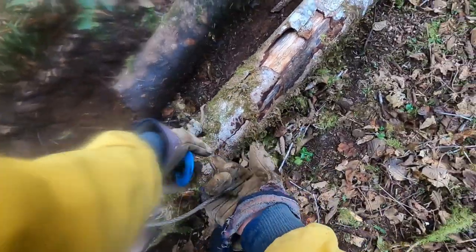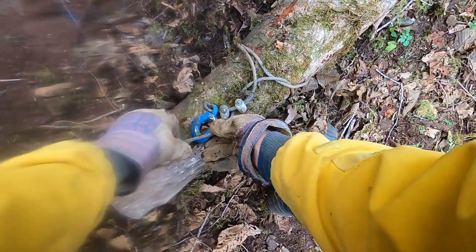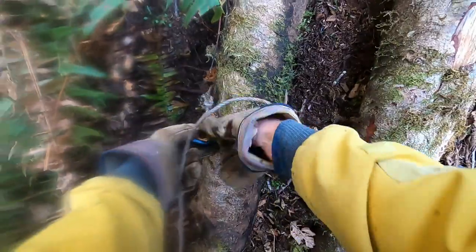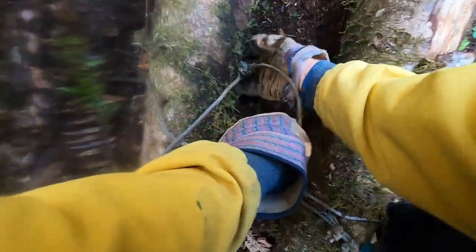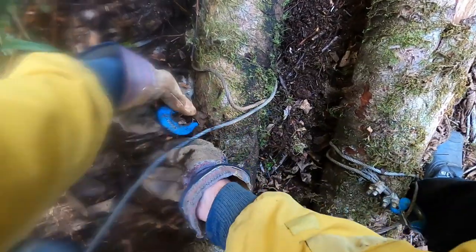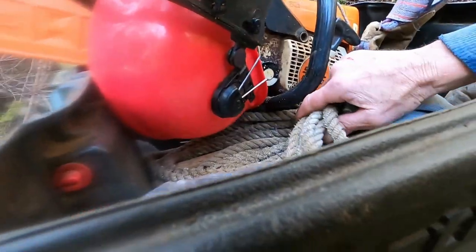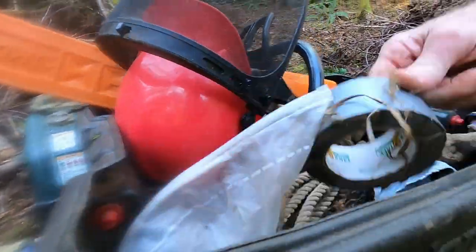The logs are small enough I wrapped the cable around twice to lessen the chance that the hook will let go, which it often does anyway. Those little spring-loaded aluminum gates are supposed to keep the cable within the hook, but they're so flimsy they broke the first time I used them. Duct tape works well to hold the cable within the hook, but of course I didn't have any duct tape with me — or so I thought. Oh, look at that — duct tape!